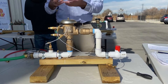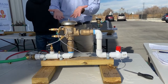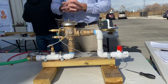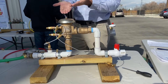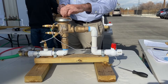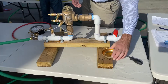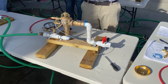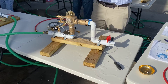If you have something stuck in the air inlet, water's going to be running all over. By the time you go to take the test, it's going to look very funny, so they're not going to simulate that. Maybe someone might pull the spring out to simulate a non-opening one, but you won't find that on the exams we host. We're going to focus on the ones you're most likely to see on your exam: leaky outlet shutoff, leaky inlet shutoff, and leaking number one check.